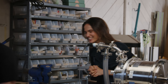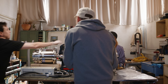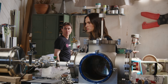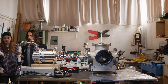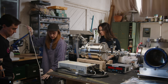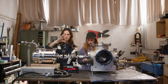We're starting with the fusion fuel — deuterium. But then the sound changed and we lost a breaker. We popped the fuse on that, which shut all the power down and then air started leaking back in. We unplug everything and plug it in straight there. You can't do fusion with a bunch of air molecules in the chamber, so we shut everything down, rerouted the pumps, and vacuumed the air back out again.